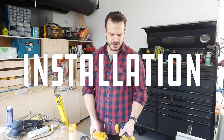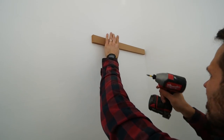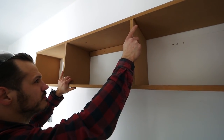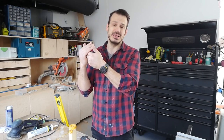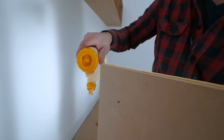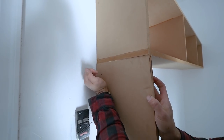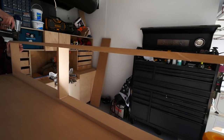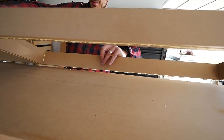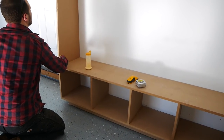For the installation part, I basically took scraps of a one-by-three and drilled it right into the studs on top, put the cabinet on top, then countersank some holes with screws butting it right in — that's what keeps it from coming forward. The cabinet touching the side wall I found a stud and drilled into it, so that was my major anchoring point. On the left-hand side I had a little dividing brace — that little angled wall — to reinforce it. My kids still climb on it and try to hang off of it. The base was done the same way: the one-by-three attached to the studs, cabinet set on top, screws on top to anchor it, and the base is already sitting so it's not going anywhere.